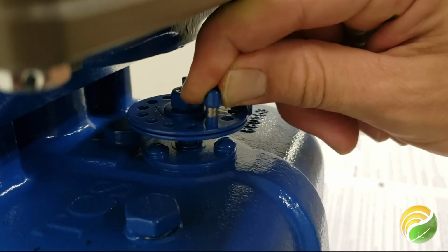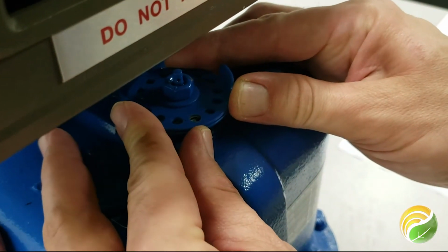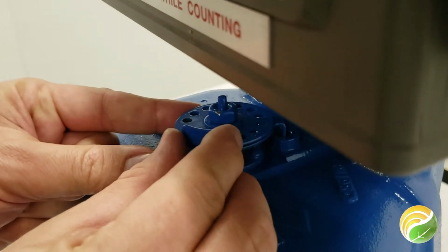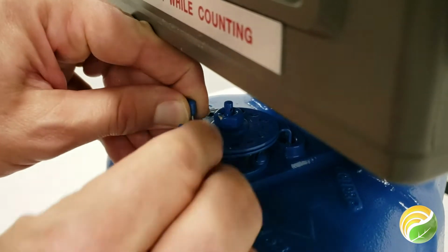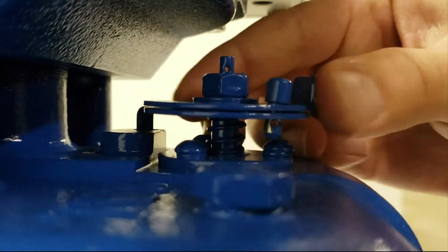Slowly remove the seal pin that is in the discs and rotate the index disc on top to make the adjustments. Turning the disc counterclockwise increases delivery and clockwise decreases it. Once finished, put the pin back in place and retest. If the test is satisfactory, secure the wiring seal and put the tag back on the meter.